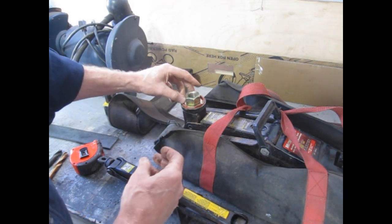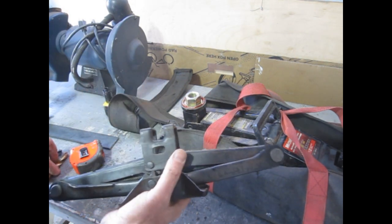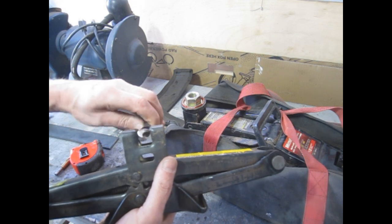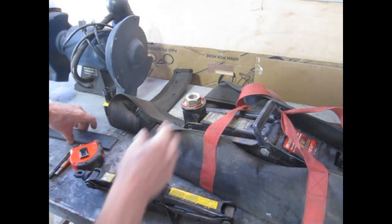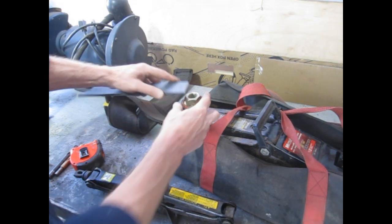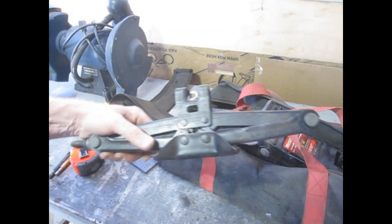So I think what I'm going to do is carve this nut in half and then separate it so it'll fit that gap. This is a half-inch bit and it's a little loose, and a nine-sixteenths bit almost goes in. So it'll be about nine-sixteenths of an inch by the depth of the nut. And once I've split it, I'll weld some flat iron — cut it accordingly — and weld a couple of strips to the nut, the nut to the washers. Then I'll have this little drop-in attachment in order to lift the car up from the side, from the same jack position you would normally use.